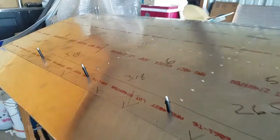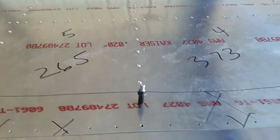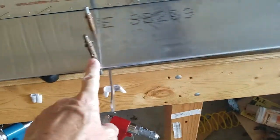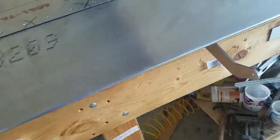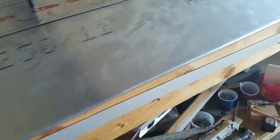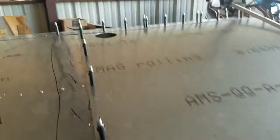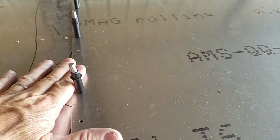Okay. Well, as you can see, I have this wing riveted, at least riveted in the places that you can rivet it. The trailing edge, as I've mentioned before on the last one, stays clecoed until I run wires out to the tip in case I put lights or something on it. So these won't get riveted until just before installation. This is the panel that covers the fuel tank, so it will stay unriveted until the fuel tank is installed.